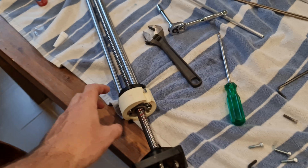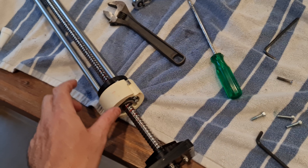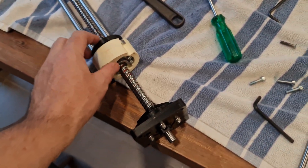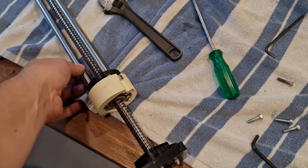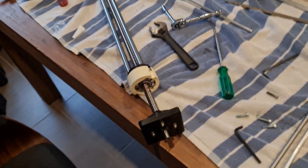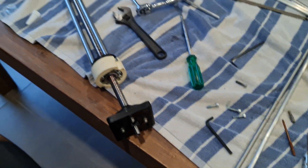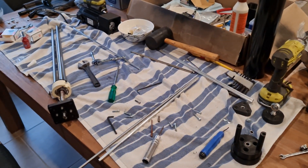I'm putting the spacers on every actuator for added security. This one seems pretty tight. The first actuator I built I forgot to put loctite on — all the bolts were loose and one had come out — so make sure you loctite everything. This one is still as sturdy as when I built it, so the loctite is working. Not going to do a full build video since it's pretty self-explanatory — all I've changed is the top section. Hopefully we can get some dirt action going soon.